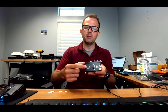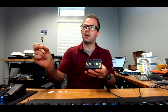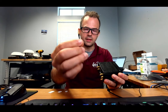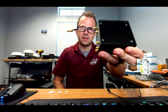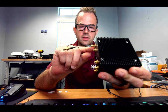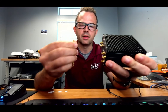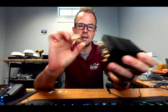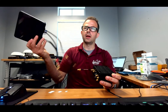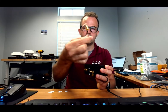It has MMCX connectors and these are kind of tricky. I have an MMCX to SMA adapter here. The MMCX adapter plugs into the MMCX port on the router. Don't be tricked — if you buy the MMCX to SMA, they both look like they would not connect to each other, but it just slides in and locks in. I have my antenna for the demo today set up and already wired with four of the MMCX adapters. I just went on Amazon and got MMCX to SMA adapters.